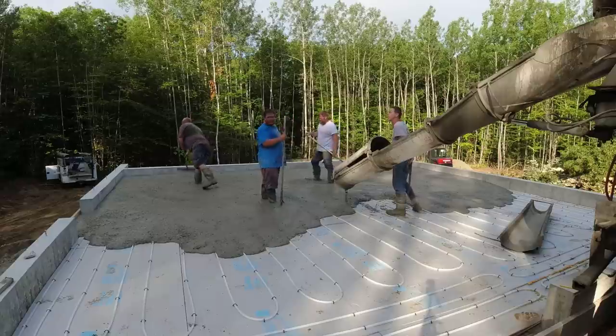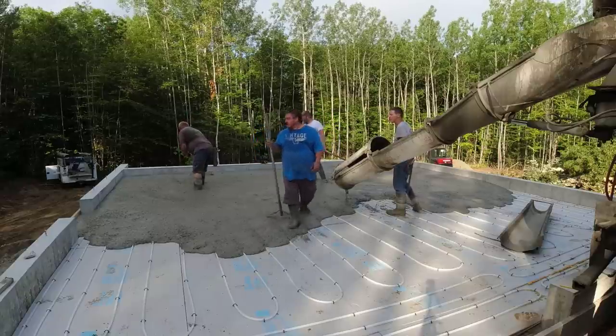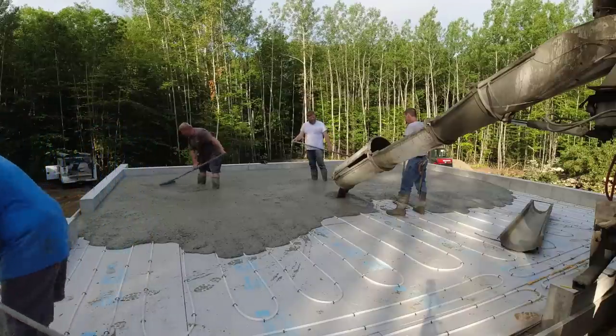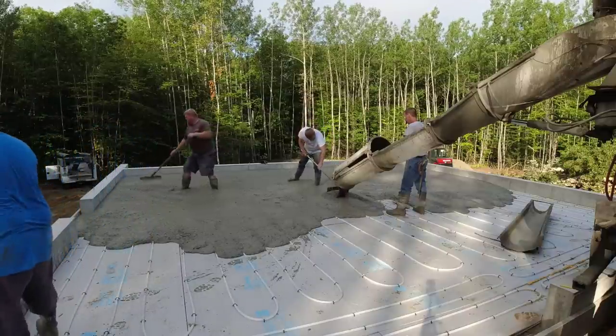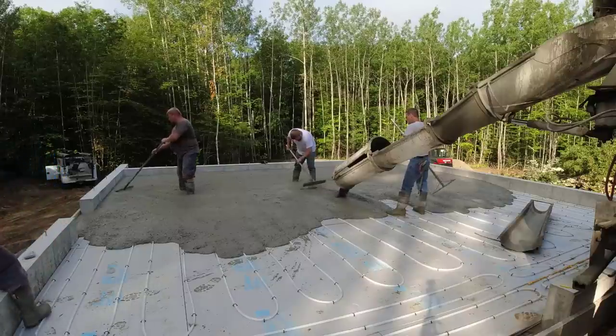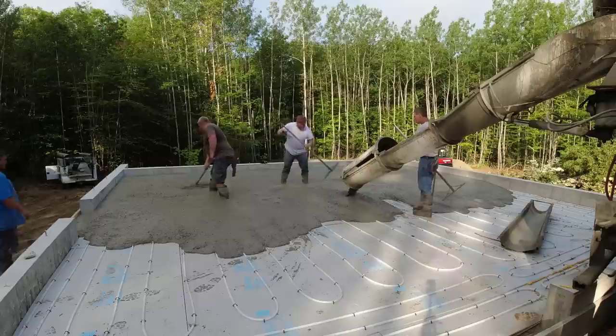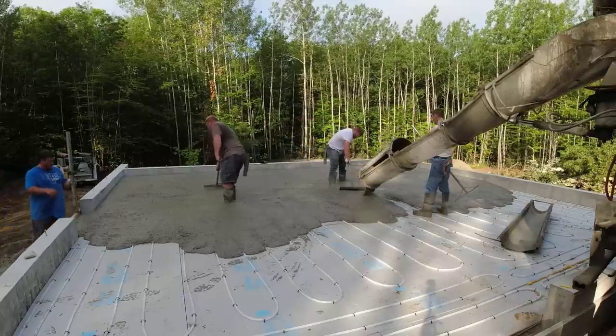If there was a cylinder test taken on this, which I have a video about, I can link that for you if you want to see it. This 3,500 PSI concrete would probably break at 3,800 to 4,000 in 30 days.